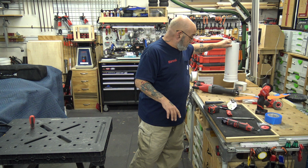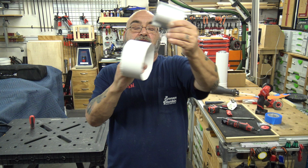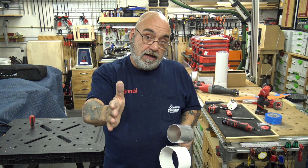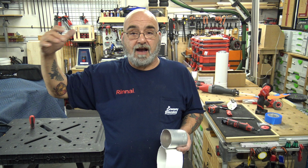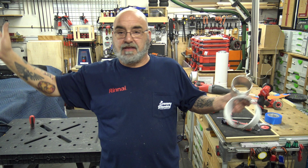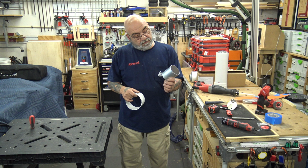So here's the two ends. See, just a half inch bigger. Now that one, actually, is a little bit bigger because that test piece is the piece that I show of a person that actually cut the pipe straight through, like you're cutting a piece of wood on a miter saw, boom, straight through. And it was sucking the carbon monoxide back into the burner, on a brand new unit. They didn't know why. They called me, I went down as soon as I heard it. Well, we had to take the vent apart, and there it was. So we ended up putting in a new 19, well, recutting it to whatever it needed, and the thing worked. So I kept it and used it as a demo piece, and I use it now to show you how to cut. Okay? So that's what that is. That's how you do it. Very simple.